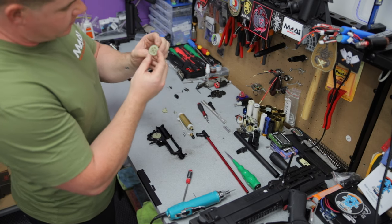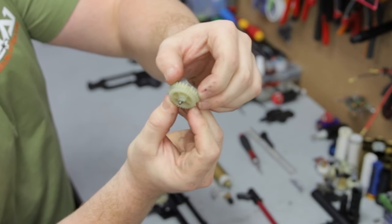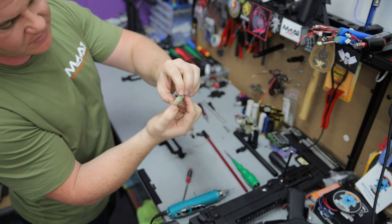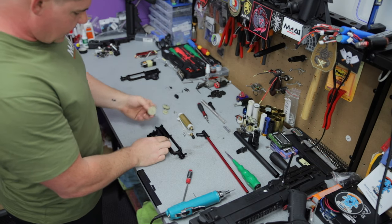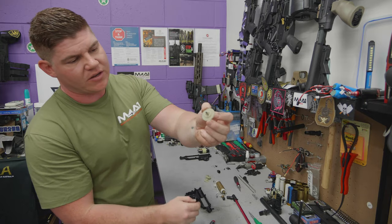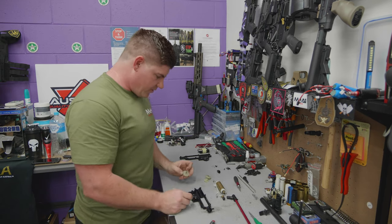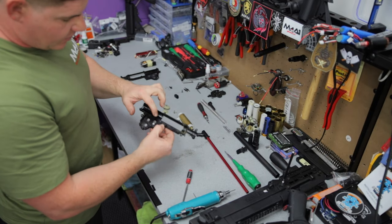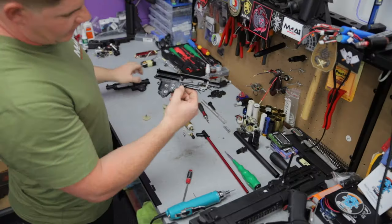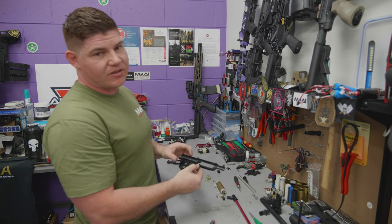You can move out your sector gear here - same thing, quick inspection. Looking very nice - no signs of wear. Yes, there is a little bit of old grease on there, but still in great condition. Spur gear - beautiful. Same thing again guys, great condition. These gears still look brand new; there are no signs of any wear on any of the edges, no beveling over - they're all perfect. You will notice on my spur gear there was no shim on the sector gear in the base or in the top, no shim on the spur gear top. But I do also have a shim underneath the spur gear and this one here is a 0.1. So I haven't shimmed it a lot - just enough to keep it where I would like it.